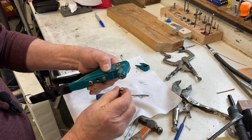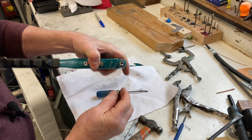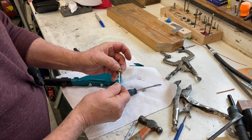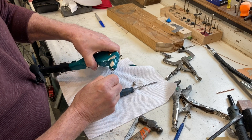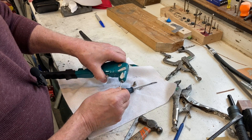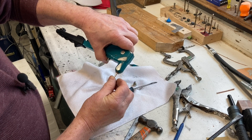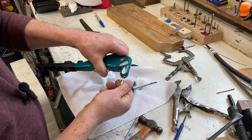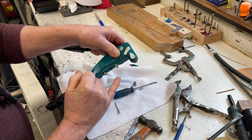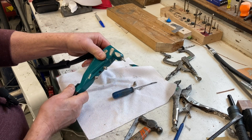Take the tip you're going to use — say for your A5s. Once the rivet goes in further, the only thing that changes is where it grabs the shank — it'll just grab it a little further down the shank. The other thing is the head gets closer to your workpiece, which isn't going to hurt anything for clearance. A lot of rivet guns build these quite tall and that is not necessary for what we're doing.